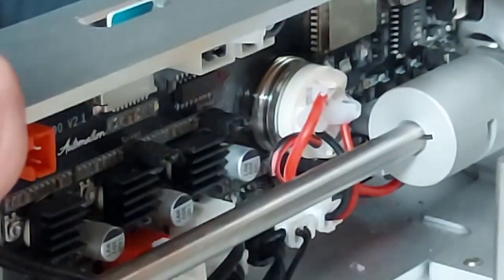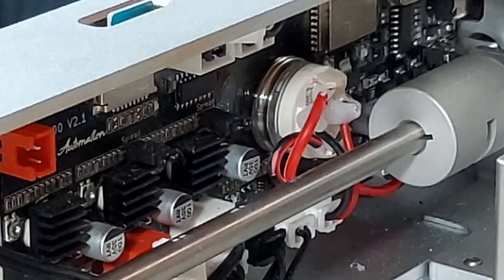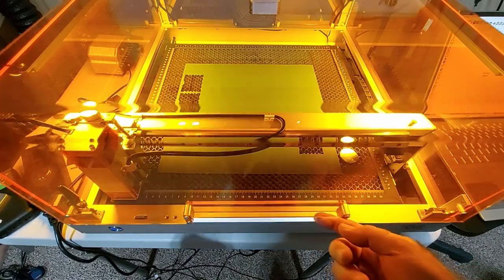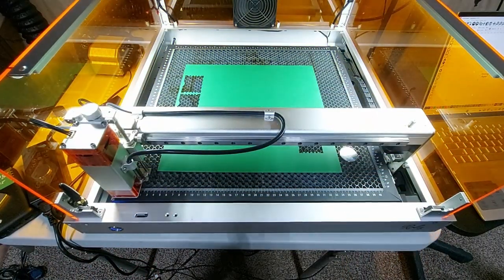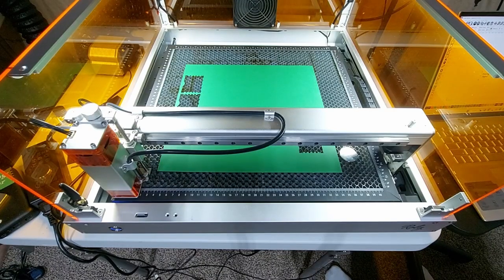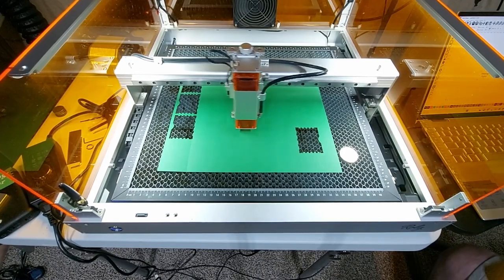Now the machine is bypassed. I'll tuck this one up on top so it's not on the roller. Both limit switches are now disabled — that will allow you to open the door while your laser is working, which I don't recommend, but for some of you that want it, it'll work. I've turned on the laser with the limit switches bypassed and I'm going to open the lid and run a job. I'll load a job quickly in LightBurn. Make sure you have your safety glasses on.